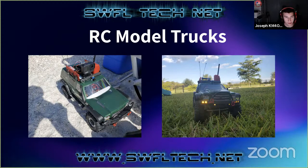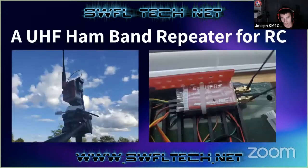So up on the roof rail, I've got all my equipment. Inside of there is the battery, and this is what the little long-range module looks like here. These are on ham frequencies as well. This is not so much amateur television, but it is amateur radio. You do have to have a license to use these. They do tell you that when you purchase it. And luckily I do, because it operates on 433 megahertz. The transmitter has an output power of about 500 milliwatts, but you can upgrade that to whatever you want using a linear amp or getting a different model.